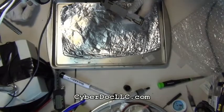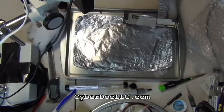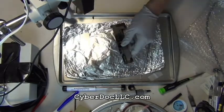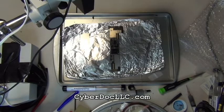I like to use a microscope for this repair. You don't really need one because if you have good eyesight you can actually see the filter and the IC, but having a microscope just makes it easier. This microscope is currently set at 10x magnification. The best soldering magnification is probably around 10x to 20x. 10x magnification is the usual one for soldering; 20x is when you want to work on really small pitch pins.